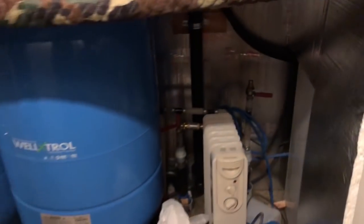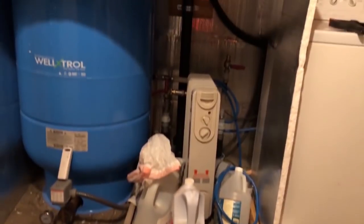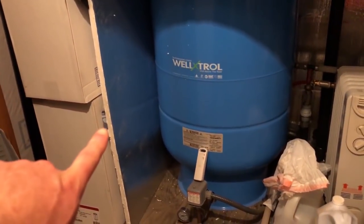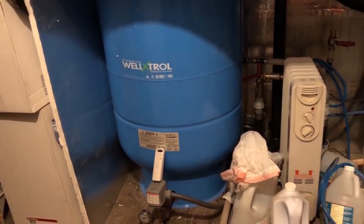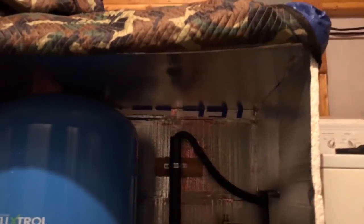Now, something I realized on the Christmas Eve that our pressure tank system froze and we lost water on our property was that you don't actually have to insulate an entire building in order to keep your plumbing system from freezing. If you do things right, you can localize all your plumbing to one area and then build a box around that using styrofoam insulation and actually have a little zone that you can heat quite easily with a little space heater or even a heat lamp, and it won't cost all that much to keep going. I finally did that in that pump house, and it saved me a ton because I wasn't having to heat the entire 12 by 8 foot structure. I was just heating a space the size of a washing machine and a dryer next to each other.